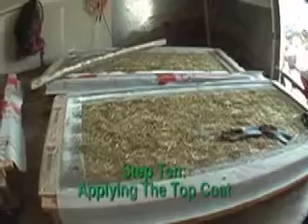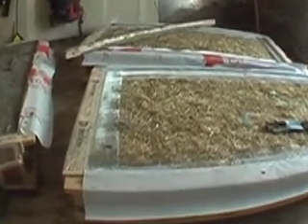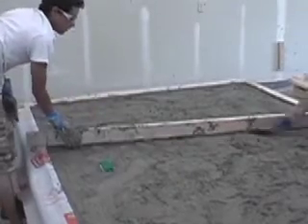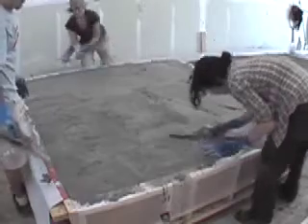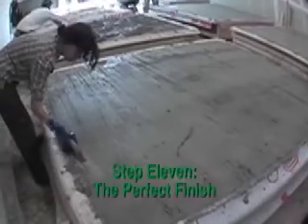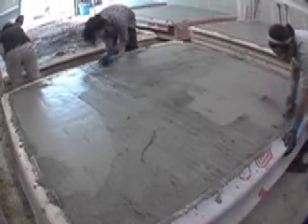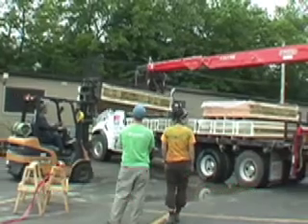Once all the bales are in, they are pressed down into the plaster with a little bale dance, and then they're ready for a top coat to go on after some additional mesh and vapor barrier is applied around the edges. The second coat of plaster will also be an inch thick and it will be worked into the bales vigorously, then screeded off and brought to a nice finish. Usually this top side will be the interior finish of the wall, so more care is given in troweling out that coat. The idea is that the panels can be brought to site and painted directly on this surface, so the finish here is quite important, although if you wanted to do a skim coat on site you wouldn't need to.